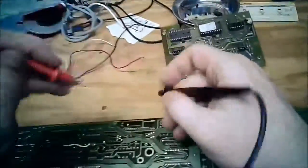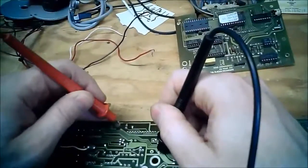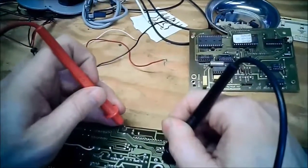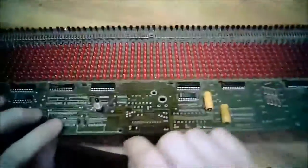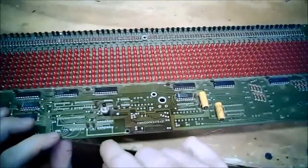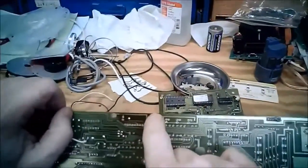Huh. Somewhere along the way here, this ground got separated from this ground. And I'm guessing it's this hole. This is kind of, not a design flaw, but you know, you want to avoid this when designing cards. In this case, they have a mounting hole which you put a screw through, acting as a carrying via to connect this trace to the trace on the back side.